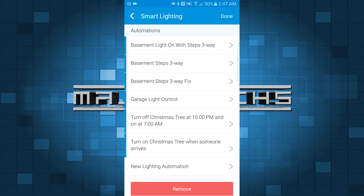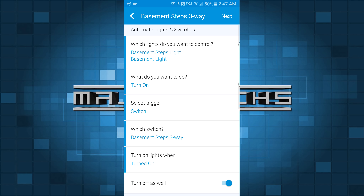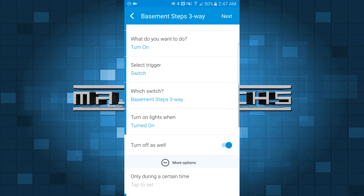The other alternative, if you don't have a mini-mote or just need something up and running in the meantime, is to let SmartThings do the association through Smart Lighting. Just go into the app and set it so that when the accessory switch turns on, the main switch turns on too, and same for turning off. There's no way to get the accessory switch to dim the other switch if it's a dimmer, and there will be a slightly longer delay since the hub has to process the command — it won't be as fast as a direct Z-Wave association.